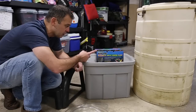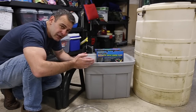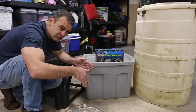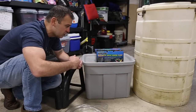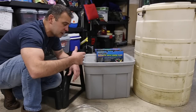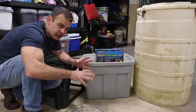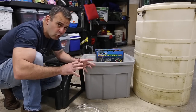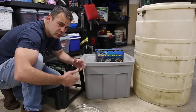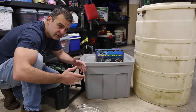This was the hardest part, doing the calculation. You've got to figure average depth, not just the total depth, because you'll get a pump that's way too big. You don't want too big of a pump because then you've got to slow it down so you don't overwhelm it. And if you get a big pump, you've got a lot bigger pipes and all that stuff. I wanted to keep it to the inch and a quarter range for all my piping, because once you get above inch and a half or 2 inch, it starts getting very, very expensive.